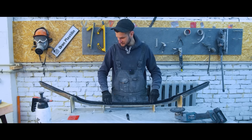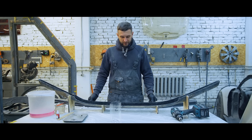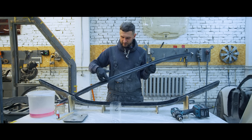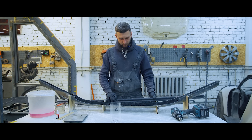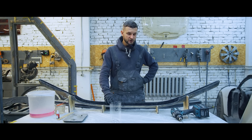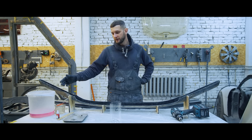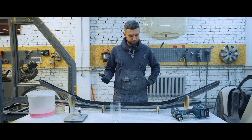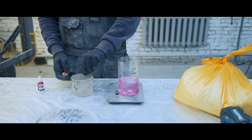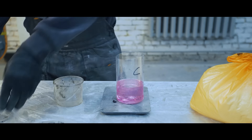I can't wait to unpack it. At first glance it's just black because it's matte — let's soak it with a degreaser. We had to make three pieces to get a more or less decent result. The next stage is making this central part with lights. There has to be a red strip with lights which will basically be the taillights. We cut out the central part to install the glass directly into the piece — jointless. We need to make it matte to hide the LED strip and the diodes themselves. We mix aerosyl with casting resin and color it. Aerosyl is a resin thickener with glass micro-shavings — basically dust. We add thickener at 2% proportion and add red dye.